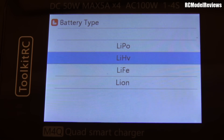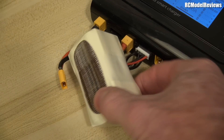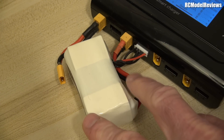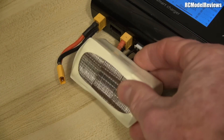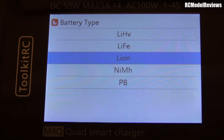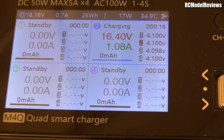You could simply connect it up to your charger, select lithium-ion as the battery type, press start, and come back when it's done — although I don't recommend leaving any lithium battery unattended while charging. The reality is a little bit more complicated because it depends on what you're trying to achieve. You can charge these packs on the LiPo setting as well and the results will be somewhat different. To understand why, let's look at the difference between the lithium-ion charge and the lithium polymer charge.